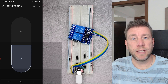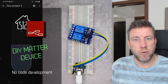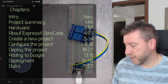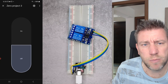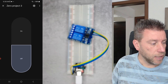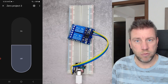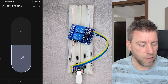Welcome to a new video in my home automation series. This is going to be a series of videos where I'm attempting to create Matter-enabled devices using a zero-code environment and DIY hardware. What you can see here is an ESP32C3 Super Mini, which is a very small development board connected to a relay module, running code I created without doing any coding at all — just menus — and it created a Matter-enabled device.